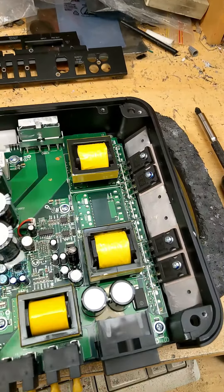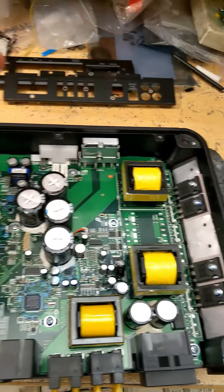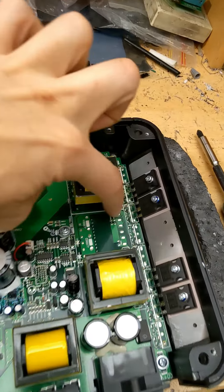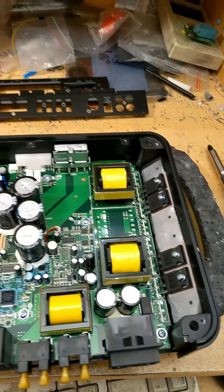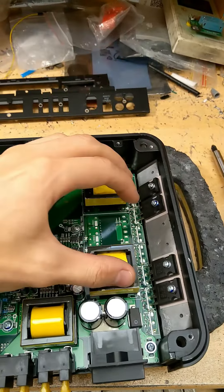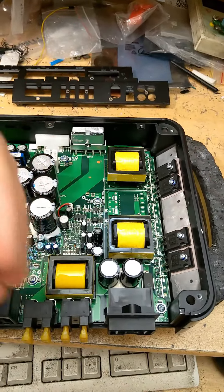You're going to ask: can you just fit more parts to turn it into a more powerful amplifier? Yes and no. The main limiting factor is the transformers - they step the 12 volts up to a higher voltage for the rail voltage. In the bigger version of this PCB you'd have different transformers to step voltage up higher, plus an additional transformer, increasing current throughput, higher rails, and therefore higher power output before clipping.